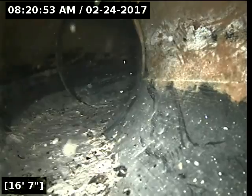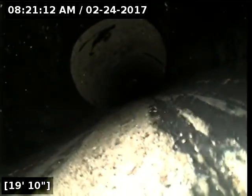I'm going to go ahead and pause the video for a moment so I can flush the toilet, just to see if I can get this to move out. I'm back. I flushed the toilet, so we should see some movement. That's just too much standing water there. I flushed the toilet and there's not very much significant movement going on. I'm going to continue to scope backwards here to retrieve my line.